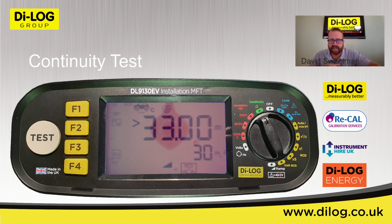So that's the sort of testing sequence we've introduced onto EV testing. Obviously, there is more to it. I'm specifically talking about the RCD testing and the RDC testing side of it as well. But like any electrical appliance, it's obviously subject to other standards. So the insulation testing, the continuity, fault loop impedance testing all still apply as if you are testing any appliance on any installation as well.